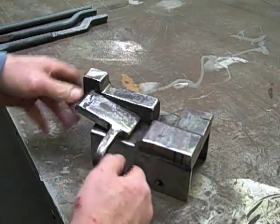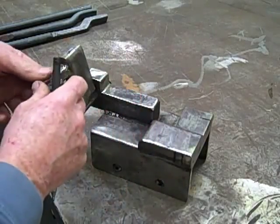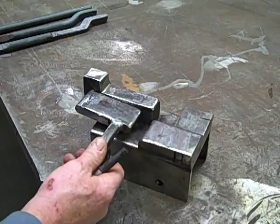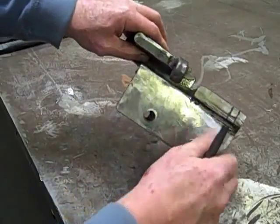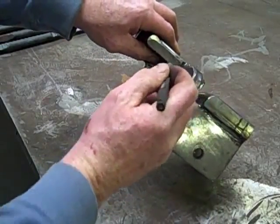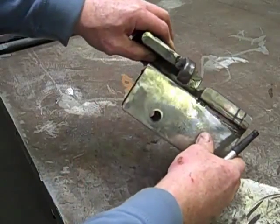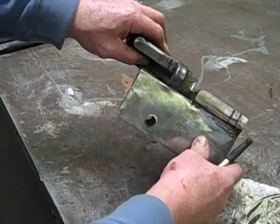To explain this a little bit: this top piece is simply a kiss block. The arm here is going to designate our offset, and if you look closely, there's 5 eighths of an inch between the bottom and this arm. So this die was actually designed to be used with either 5 eighths inch round, 5 eighths square, or 3 quarter inch round.